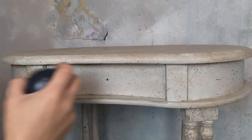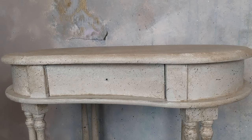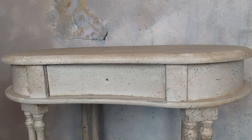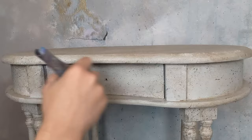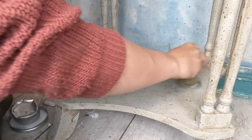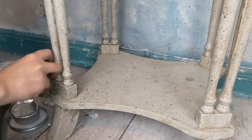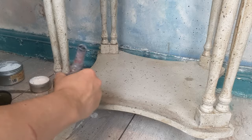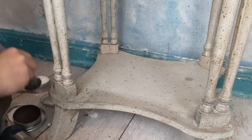Here is Beeswax White — I'll be honest, I didn't really like the way this looked, so I only used it once and then didn't bother again. Now I have some brown wax and the Belle Brush by Dixie Belle, which is a small natural bristle brush, and I'm just rubbing that all into the sides of the piece. I'm then grabbing my clear wax and blending it so there are no thick edges or big blotches. The glaze has dried a little darker around the edges, making it look worn and aged. I'm going straight in with my brown wax around the edges and the bottom of the spindles, as this helps make the piece look more antique.